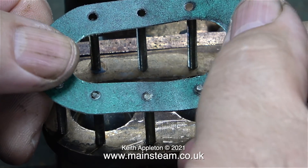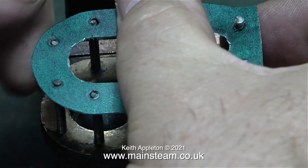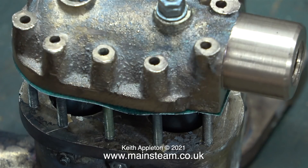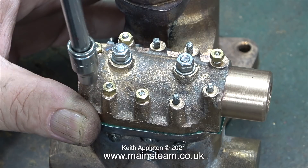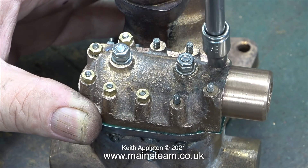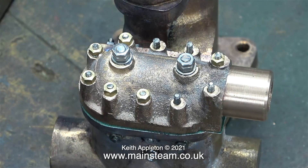For now, I'm going to show how I fitted the gasket. First of all, I carefully pressed it onto the studs. Then I removed the tiny piece of silicone rubber from one of the studs and fitted the lid in place. As I slid the lid down into position, it took the gasket with it. I decided to use brass nuts — these are 5BA brass nuts. The original ones were steel and had washers, and the studs are really not that long, so I preferred it this way.